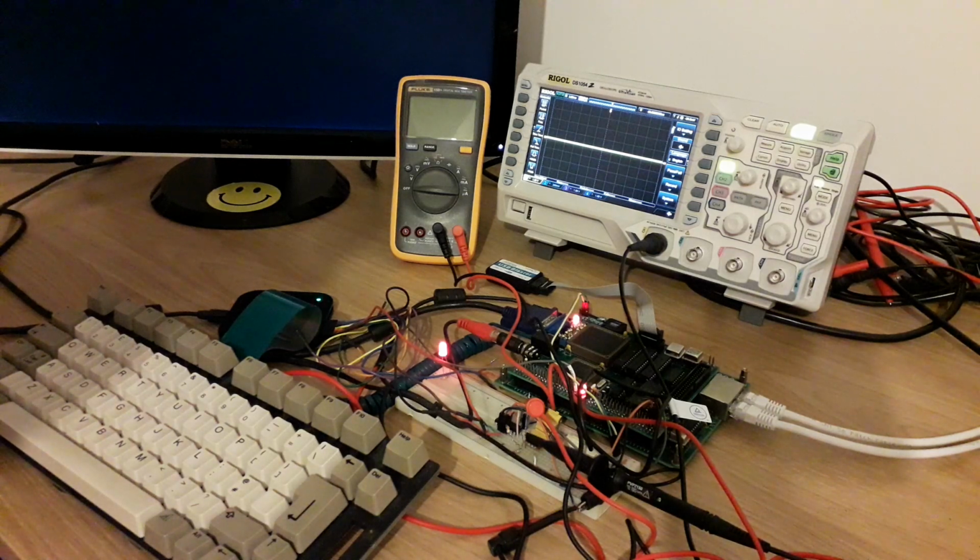So that's pretty cool. Other parts on the I/O board are an OPL2 or YM3812 FM synthesizer, an IDE interface, and another DUART, which is the Philips 68681, which was a popular part back in the day. Philips produced a PLCC variant of Motorola's. It's famous. I think it was used in the Mac. That's used for the keyboard interface.